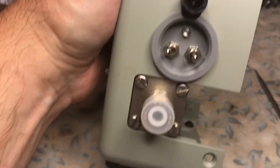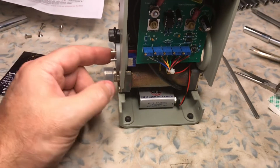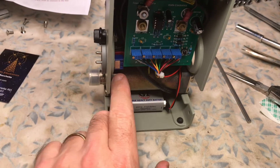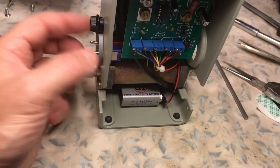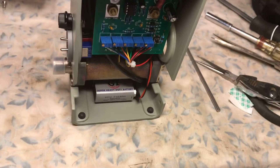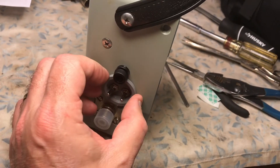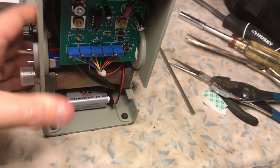See how the LED light fits right in there. What I did was: you want to slide the switch holder and LED holder into its spot, and then mount the switches to the back of it once it's locked in. Because if you mount the switches while it's out, you can't actually fit it back in. So you want to back-mount the switches with the plate switch and LED holder already installed in the meter first.